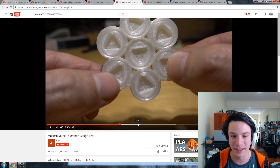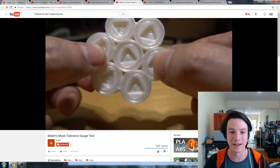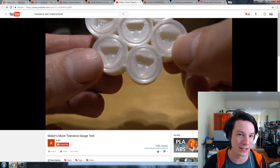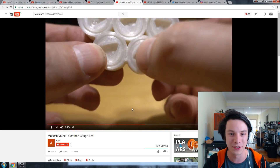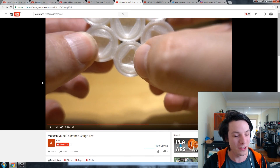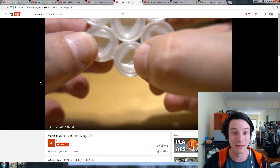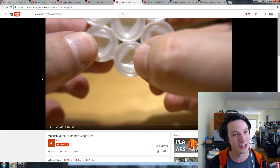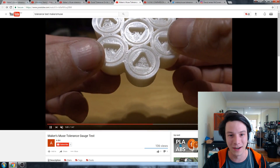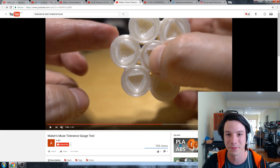In terms of the accuracies, it appears that everything works, which is really really surprising. There's a little bit of doubt that a 3D printer using FDM and a 0.4 nozzle can actually do 0.05, although it does appear to turn in this video. I'm wondering if the slicer did something to offset it. If not, that's probably one of the most impressive things I've ever seen. But depending on what slicer you're using, some will artificially offset faces. Either way, that's a darn impressive result and a very nice looking print in a pearlescent white off the RAISE. Well done ABH.